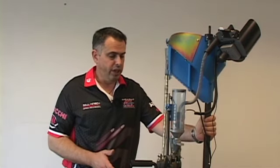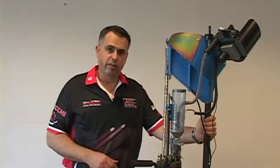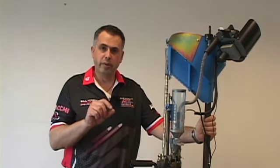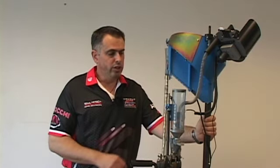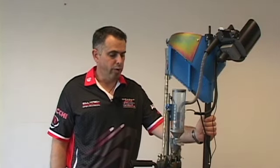Now on a 1050, most of that remains just the same. You will want to set the powder funnel the same way as we did on the 650 to make sure that you're flaring the brass just enough but not too much. You want the bullets to sit and not tip, but you don't need to open up the brass more than is necessary. You want to make sure the dropper is set correctly so that each time you bring the tool head down, it releases one bullet only to the waiting brass. So all of that setup is exactly the same as it is on the 650.